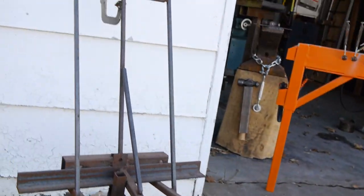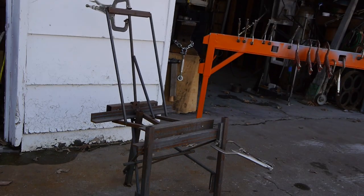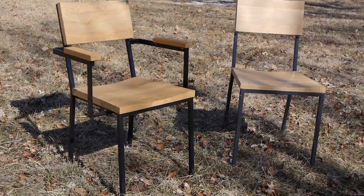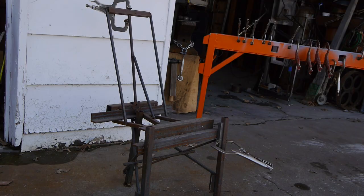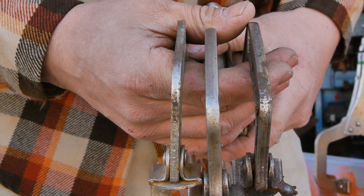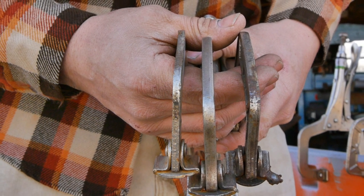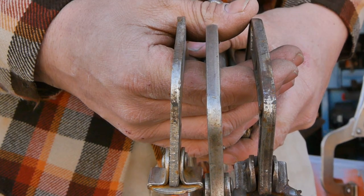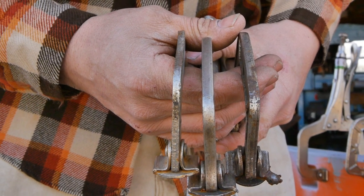Earlier I did mention the use of cheap Harbor Freight clamps on jigs. This particular jig was built for an order of about 50 chairs that I had to weld up and powder coat for a restaurant. During production, this jig would have had about seven or nine clamps tack welded to it for easy and repetitive clamping. And now for the 'do what I say, not what I do' moment — you can see here a tack that's left over from prior use on a jig. These tacks have to be ground down before the clamps are put away; they're extremely sharp and dangerous.